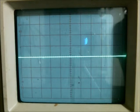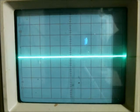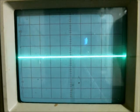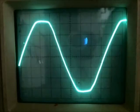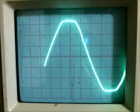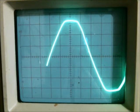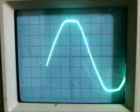Currently there is no power applied to the circuit. Let me just turn up the intensity so you can see that line a little better, and make sure that's on ground. Now I'm going to apply power. I have the scope set for 5 volts per division. Counting the divisions vertically — roughly 3.3 divisions — so 5 times 3.3 equals 16.5 volts.